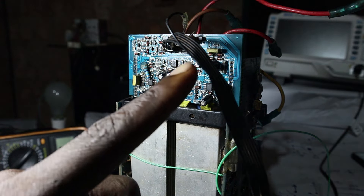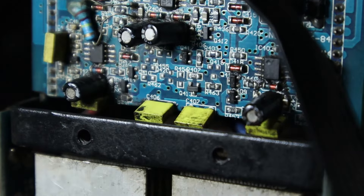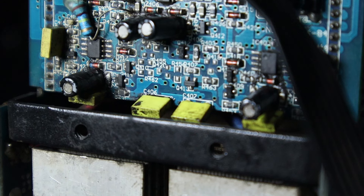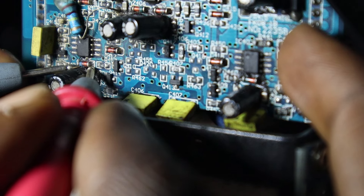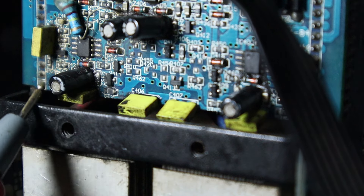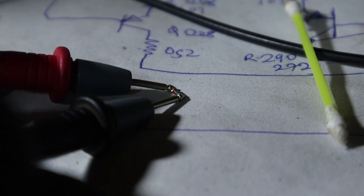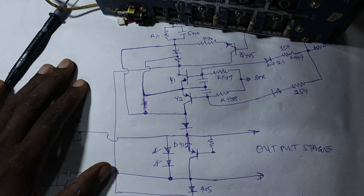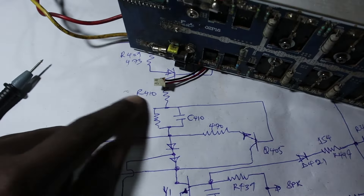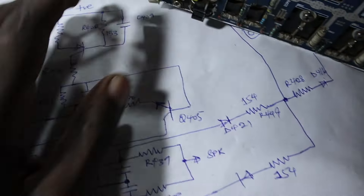This is the channel I'm working on — I've removed it and cleaned it with alcohol as the circuit board was very dirty. While probing around, I found a diode which I believe is a zener diode that is shorted — and this capacitor is shorted as well. I'm not sure yet if it's the capacitor or the zener that's shorted, but there's definitely a short around here that I need to investigate. It is shorted as you can hear. So it's yet another day of pulling hairs out trying to figure out what's happening on this amplifier.